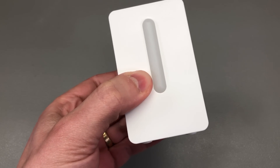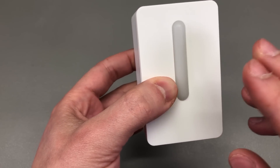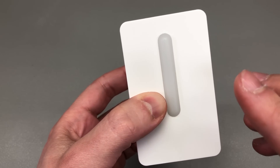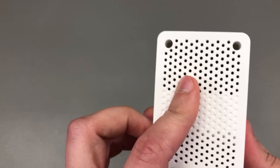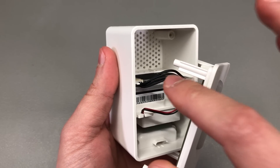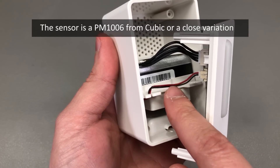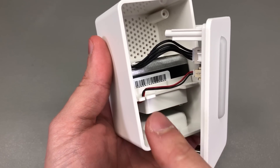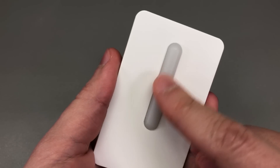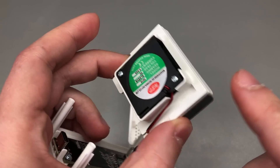IKEA sells this PM2.5 sensor for cheap — something like 10 euros — and it runs from a 5V USB Type-C port, but it only shows results using some LEDs shining from green to orange to red for very high concentration values. If we take a look inside the unit after removing the 4 Phillips screws on the back, we discover that there is plenty of available space inside for adding our own circuitry. It appears this unit is using just a standard PM2.5 sensor module with serial output over UART. The sensor data is read by a small microcontroller which controls the different LEDs on the front and also handles the small fan that pulls in fresh air over the sensor intake.